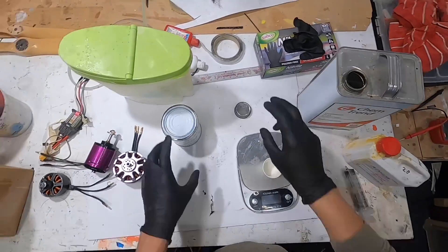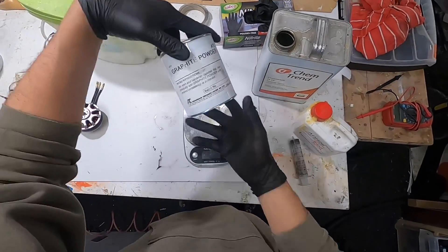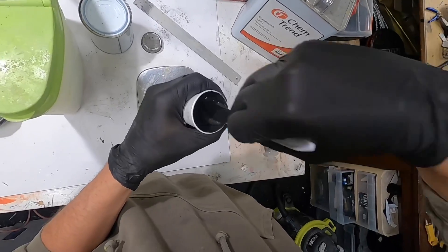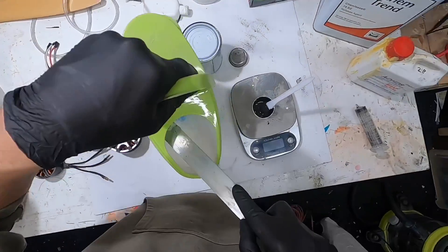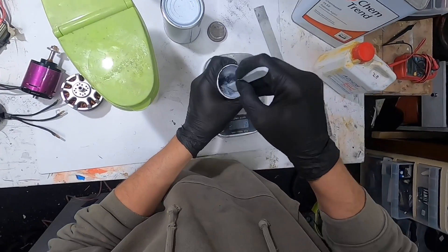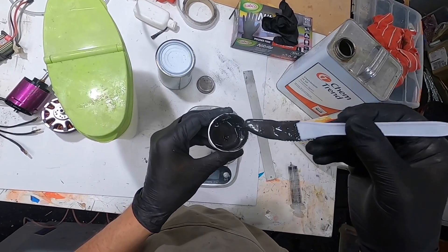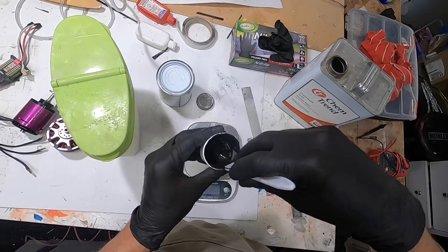The composition I use for my wiper is a normal laminating epoxy, some graphite powder, and also some microfiber — the little fibers help keep it together. I'm wiping it against the side squishing against the side to try and break down all those bits. This is still far too runny so I'm going to add some more microfibers. The consistency we want is judged by when we lift up some of the product and drop it back into the glass — it should take about two seconds for those blobs to self-level. That's the consistency I use to judge.